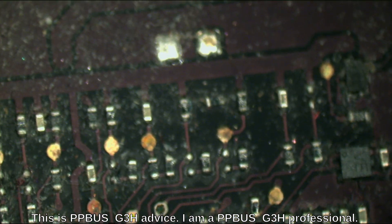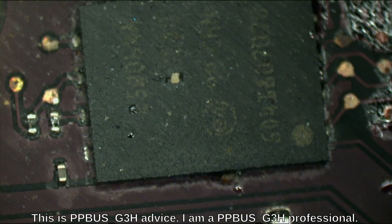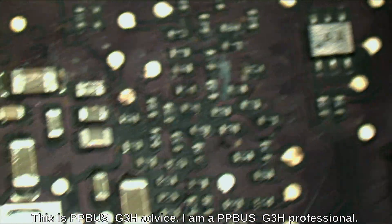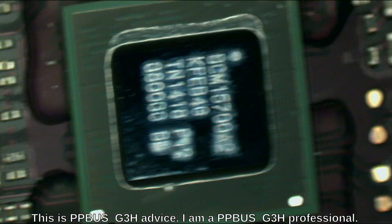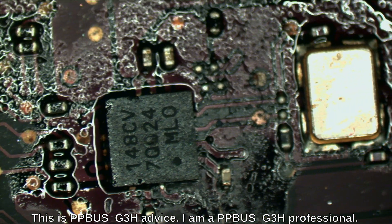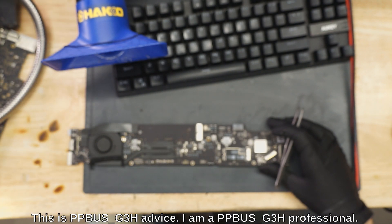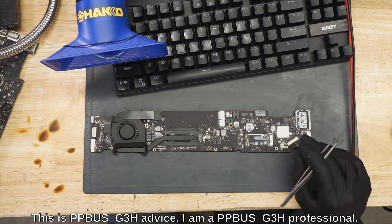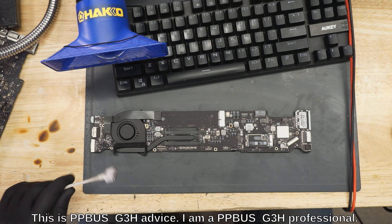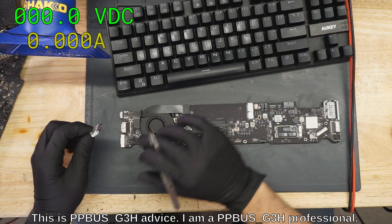There's a lot of dust on here that's going to come off in the ultrasonic cleaner. Some of this dust, if there was corrosion on it, may have that green stuff. Little solder balls are going to get cleaned off too. I'm going to give it another quick look before I toss it in the cleaner or test if it works. Do you think the issue was the shorted capacitor, or do you think PPV RTC G3 hot is going to wind up being shorted to ground at the CPU? I really hope it's not shorted to the CPU. Also, similar to my last video where I trolled myself for an hour, I did not remove the CPU heatsink first — which would have revealed whether the short was to the CPU before I worked on the board. Very close to making that same mistake twice because I'm a moron.